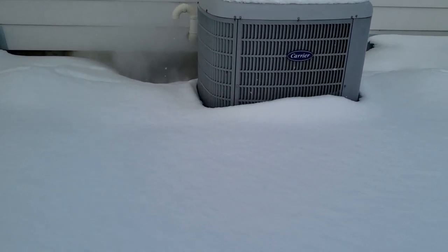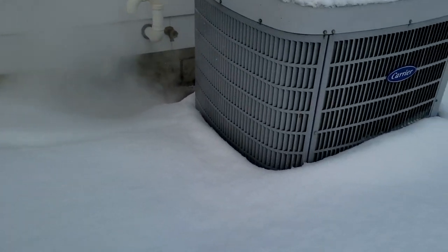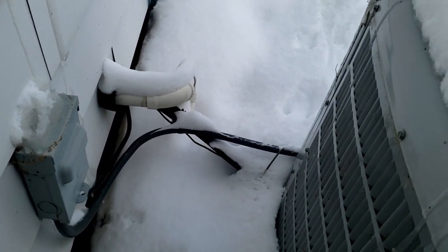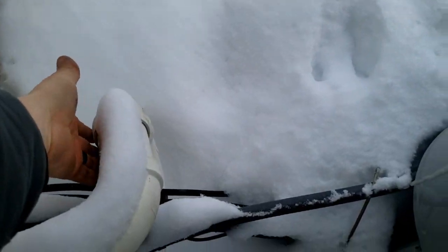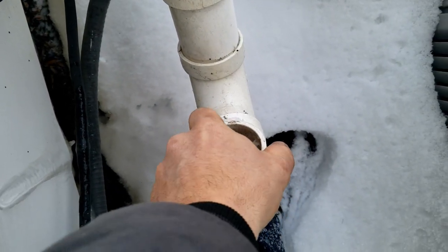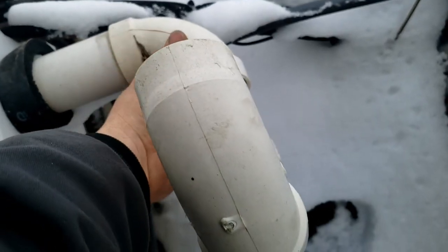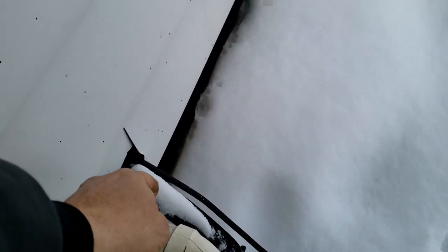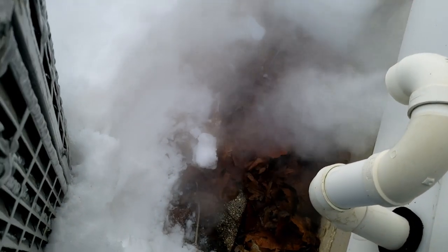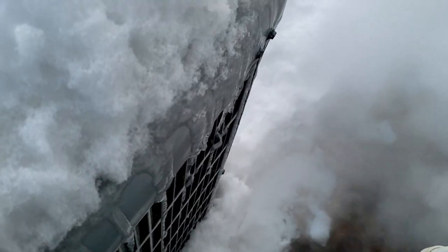So the exhaust was angled downwards, which it shouldn't have been. And the air intake is over there in the snow because somebody didn't glue it, so it sucked it completely up. There's a reason why she had daylight coming in. There must have been another furnace here before - that's the best thing I can come up with.